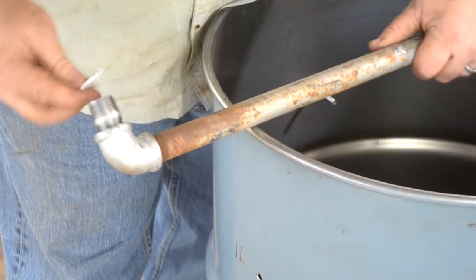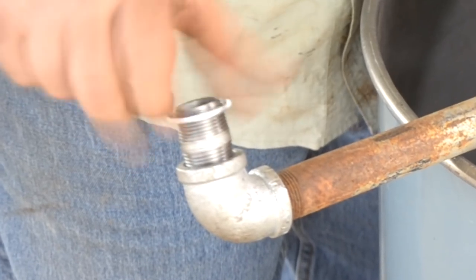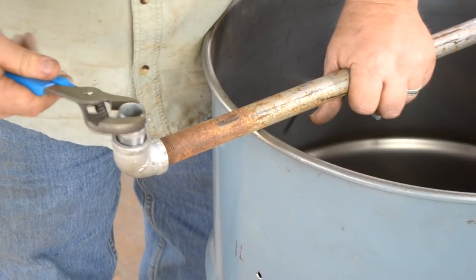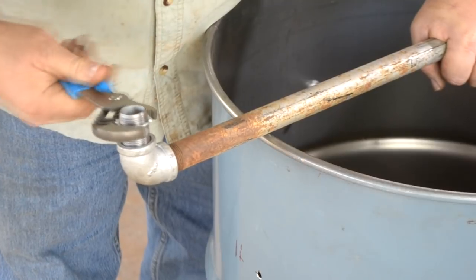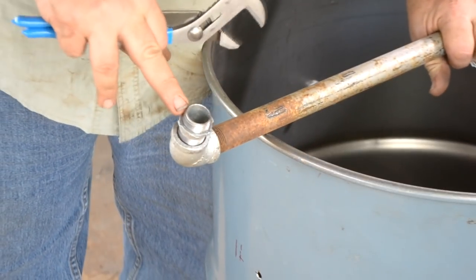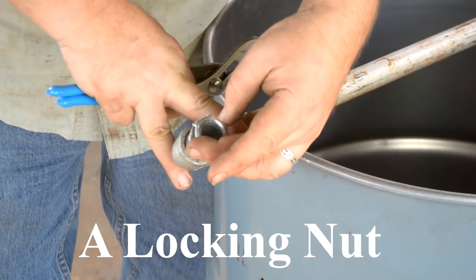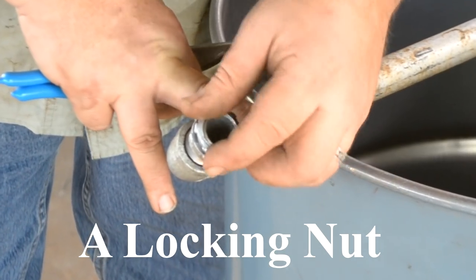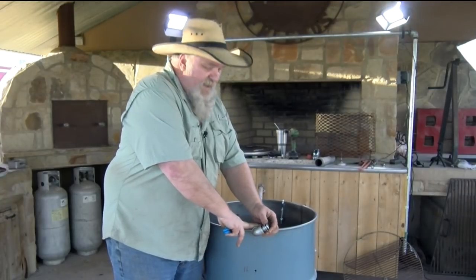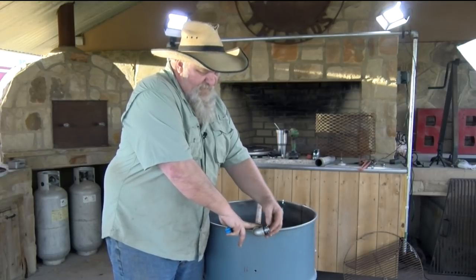Now, these are our little lock washers. We're going to put it with the teeth toward me, away from the elbow. We're going to screw it all the way up on there. I'm going to take my channel locks again and just run this nut up on there as far as it'll go. This is going to go into the barrel and on the inside edge, we're going to put another lock washer to hold it in place. Then we'll take a screwdriver and a hammer, put the screwdriver here and tap it down to get it tight. And then that will fit up tight against the barrel and hold it in place.